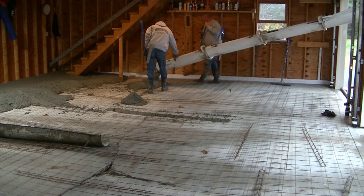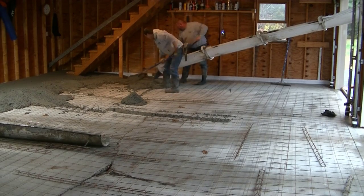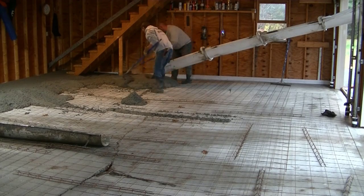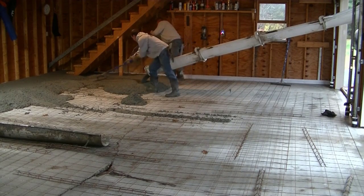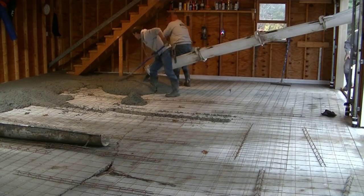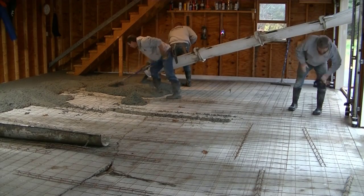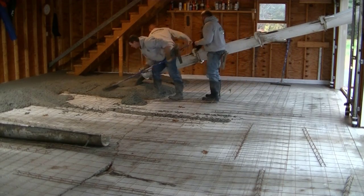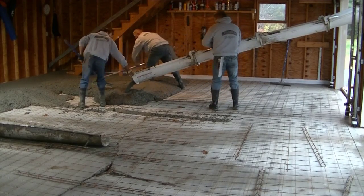What we're doing is pouring four and a half inches of concrete in the back, raising it up four and a half inches, and pouring about an average of three inches in the front. So we're pitching the slab from the back to the front — no more floor drain. There's going to be about eight inches of concrete where that floor drain is, which will cure his water problem.